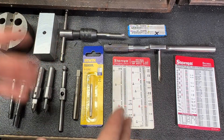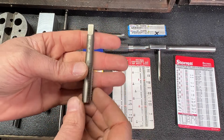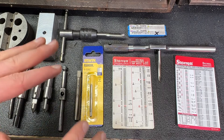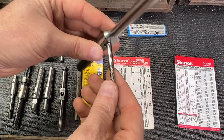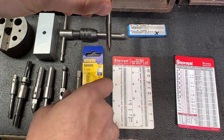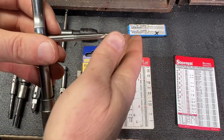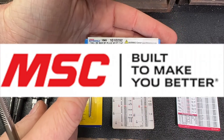Next up, what kind of tap are we going to use? Now if you go to your local hardware store, you're going to find these Irwin carbon steel taps. I like to call these the rice crispies of taps, because snap, crackle, pop is what you're going to hear — these are going to break off. Throw these in the garbage. Last resort, use those Irwin taps. What I like to use is a high speed steel tap — it should say HSS on the tap. This particular tap is a spiral tap, which will push the chip through to the bottom of the hole. We are doing through holes today, so the chip can go right out the bottom. You can see this has a spiral point — like a little plow pushing the chip down and out of the hole. You can find these spiral taps on Amazon, but do yourself a favor and check out MSC Direct or KBC Tool.